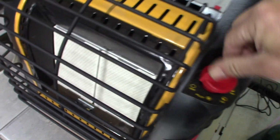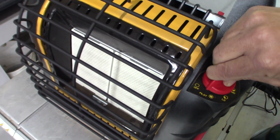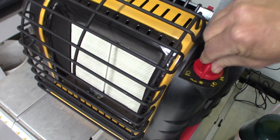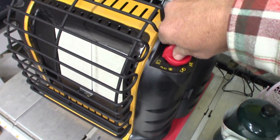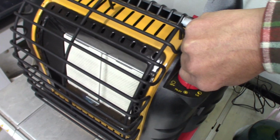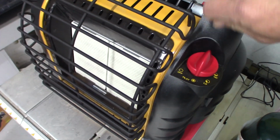All right, it didn't light. We'll try that again. Hold it down, turn it to pilot. There we go. Oh, I see, you're supposed to hold it down for a second. Hold it down, turn it to pilot, and remain holding it down for just a few seconds, and then you can let it go like that.